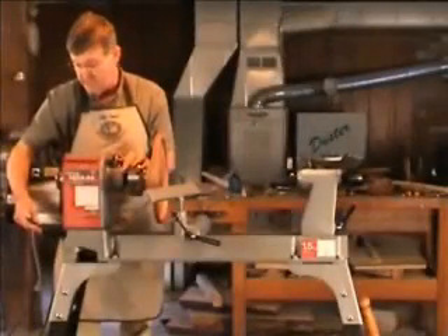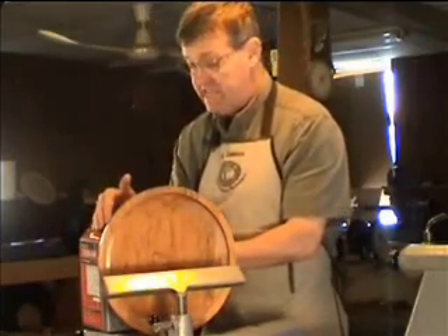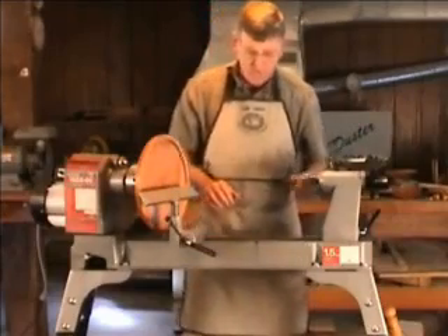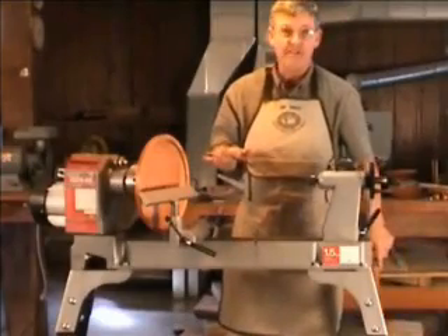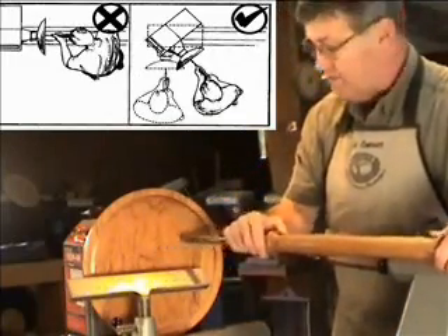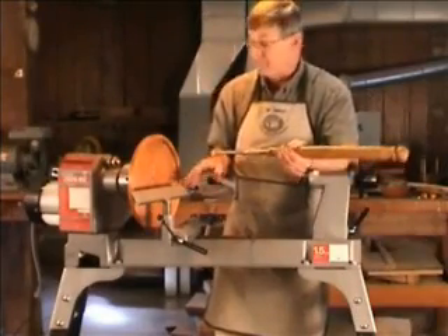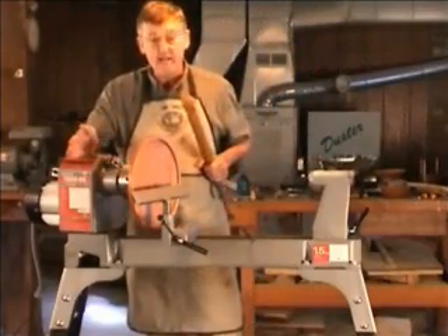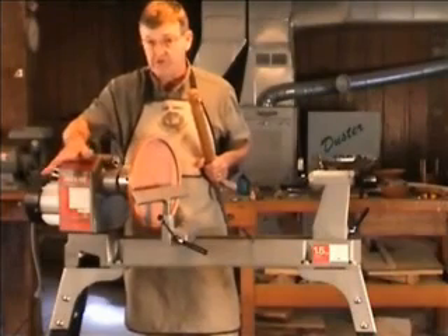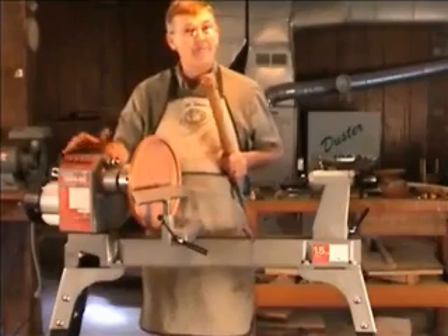This lathe is equipped with a swiveling headstock. By loosening this screw with a knockout bar and flipping this lever, we can move the headstock in 22-and-a-half degree detents. Twenty-two and a half degrees of swivel is very nice because we can simply use the existing tool rest for face plate work. It puts us in a better position — we don't have to lean over the lathe as much, which is easier on our back. With a bowl gouge you sometimes have to get way over, and you don't usually have to remove the tailstock so it's not in the way. You may also swivel all the way to 90 degrees and use an optional outrigger to bring the tool rest around, either to the front or the back of the lathe depending on whether you're left or right-handed and the space considerations in your shop.